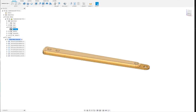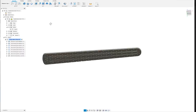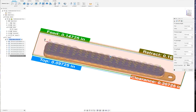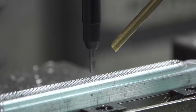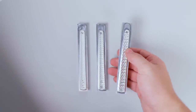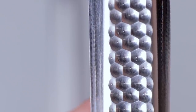But then I figured out that I could just make an opposite shape and just have it set to drill a bunch of holes into this shape and just have the drill end at the hole bottom, maybe minus another 5 or 10 thou or something. And so I was able to make a few different iterations, trying different sizes of end mill and how the spacing was, and come up with this pretty cool pattern design. But I was able to do this much faster because I didn't even bother to do the other side.